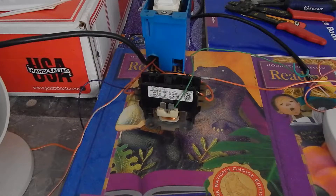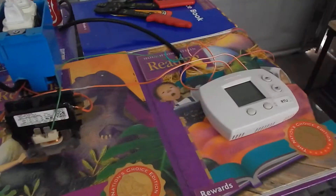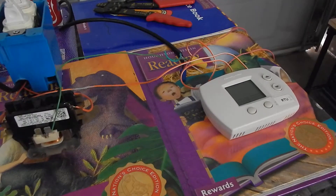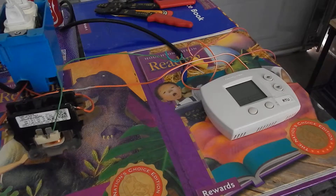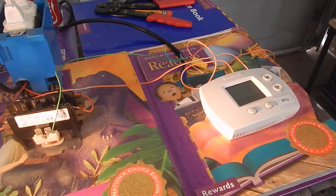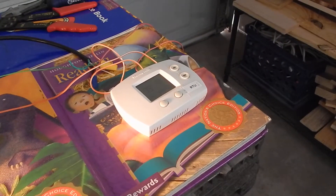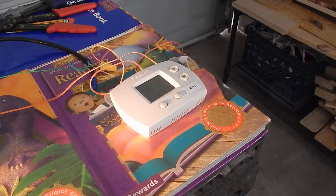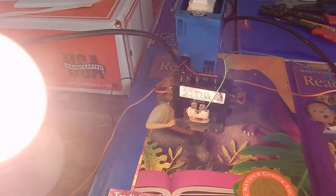You can hook a bigger load such as multiple house fans on one contactor. Here's a thermostat — turn that on and turn this power strip on, and there you go, it clicked on by itself. That was from this thermostat and that contactor. Basically, the thermostat relay in there kicks on and transfers that 24 volts — in my case I have 15 volts.